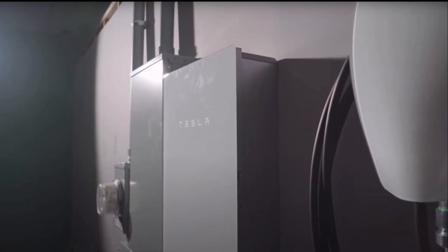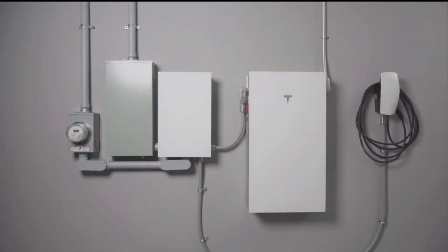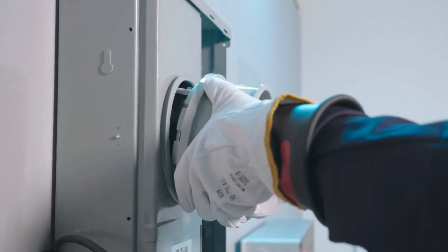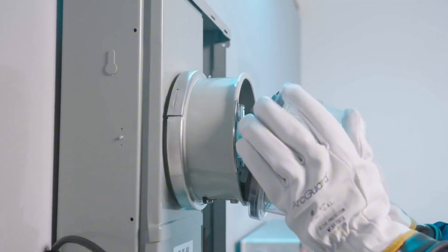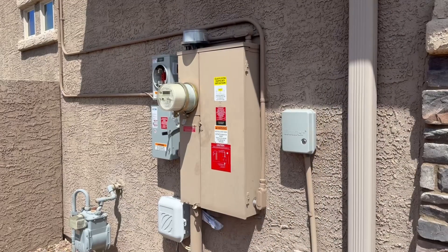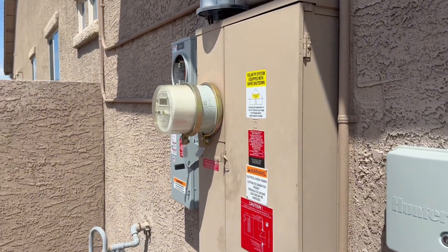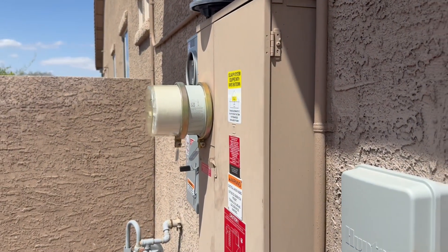They're going to sense a power outage and then flip your home off-grid within milliseconds. Using the gateway is and has been the standard process of installing the Powerwall system. But if we are able to use the backup switch, that can introduce some benefits. The main advantages of the backup switch are smaller form factor, easier installation, and lower overall cost. Your installer can essentially use your home's existing electrical system as-is and back up every circuit within your main panel — it's a true whole home backup.